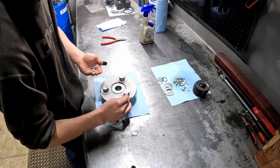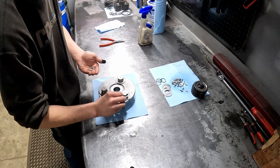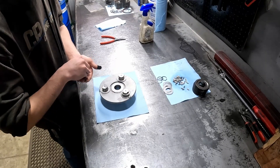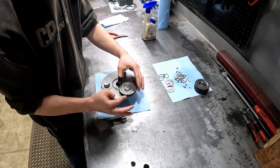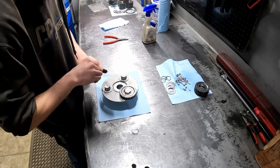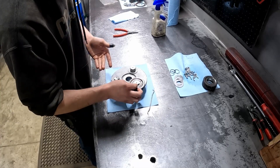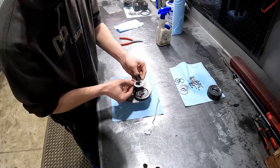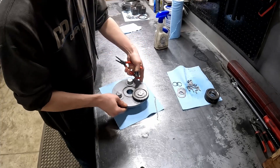The reason I do it this way is because it's a little more tedious trying to get the bearings between the gear and the post. So doing it this way — about half the bearings around the post — it's a little bit easier to line that up and set it right on. Then I'll put pressure towards the bearings and turn it. Go ahead and get the rest of them in there. Make sure there's all your bearings in there. Once they're all in there, we'll go ahead and throw that outer washer over — this one has a tab going inward, which will go right into that divot on your gear post. And once that's in, we go ahead and throw a snap ring over this gear. And the first one is done.